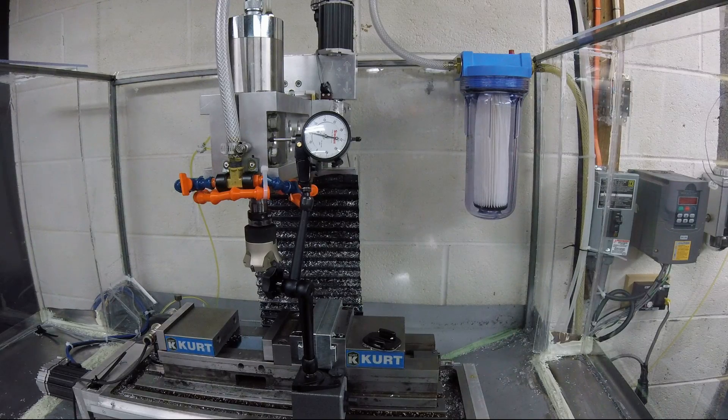You need to go back and find out what it is. Is it the ball screw itself? Are your bearings moving? Is your coupler not tight? Is your stepper or servo moving because you didn't tighten the screws all the way? It could be stupid stuff. Just take your time, set it up right, and you'll be much happier down the road. You won't be wondering why you're not cutting a nice circle — it's because you didn't take your time and set the comp right and set your steps per inch, or your revolutions per inch.